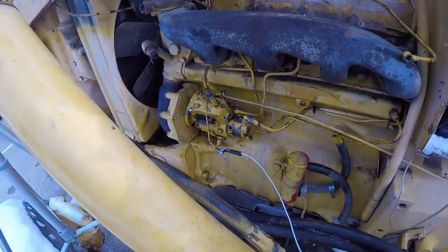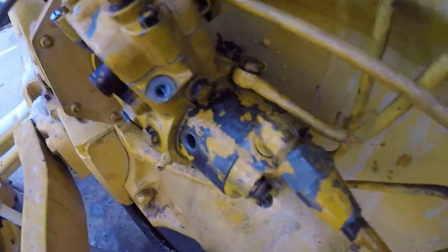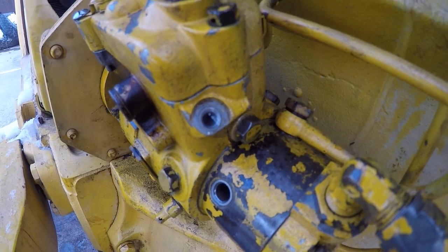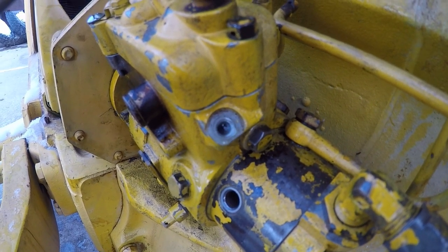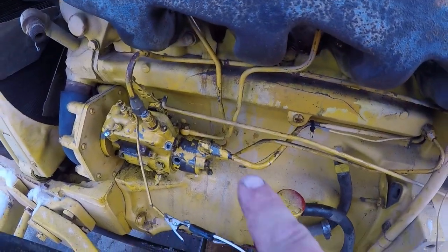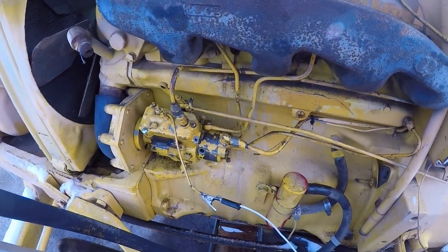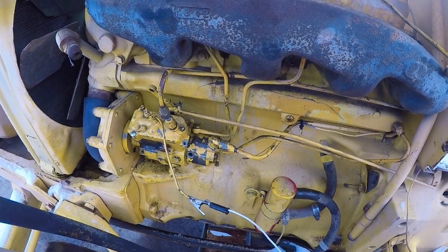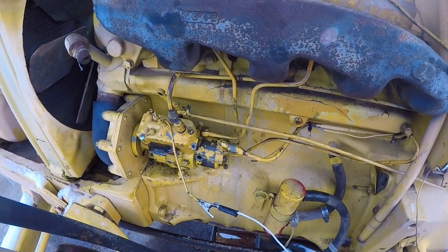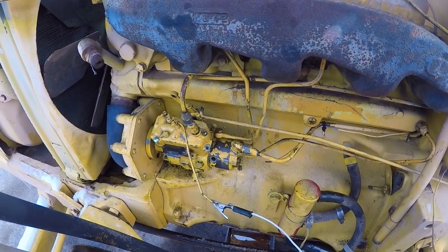Hey, welcome back. I am out of time for today, but I wanted to share this with you very briefly. I fixed the solenoid. Whoops, let me get the camera around here. We got the engine cranking over again. That's that vent hole. Check that out. So that definitely means that the vane pump is working for sure, and we do need to replace that spring in the regulator side of things. But that's a real good sign. What's not a real good sign is how that engine labors after just a little while. I'm not sure what that is. Maybe it's just because it's cold.